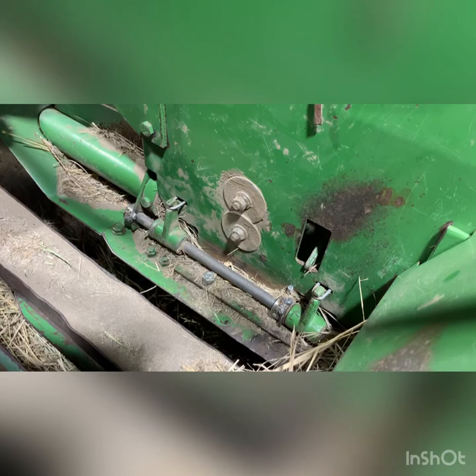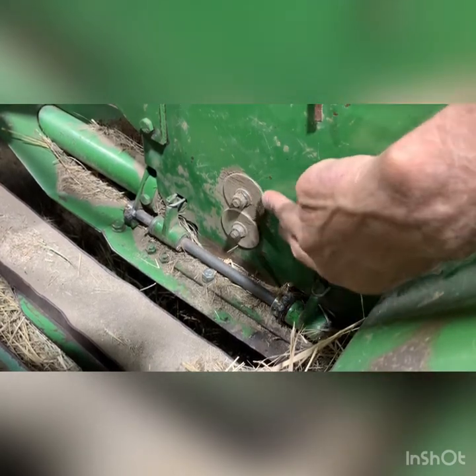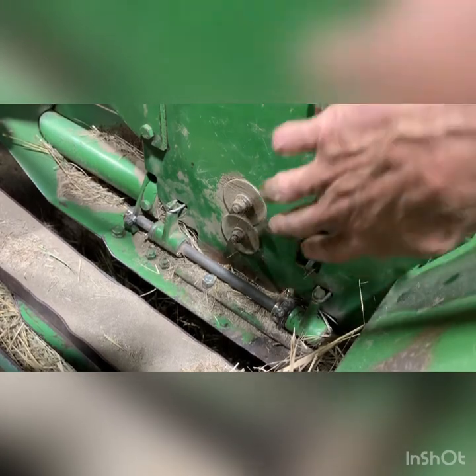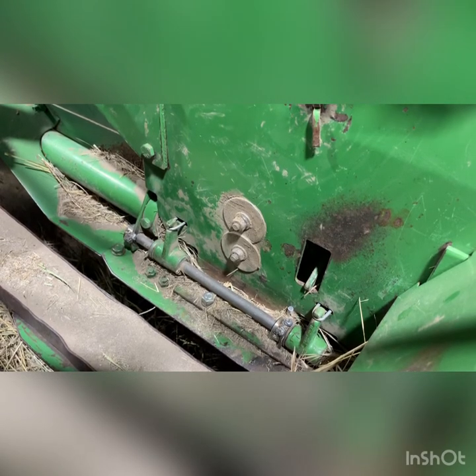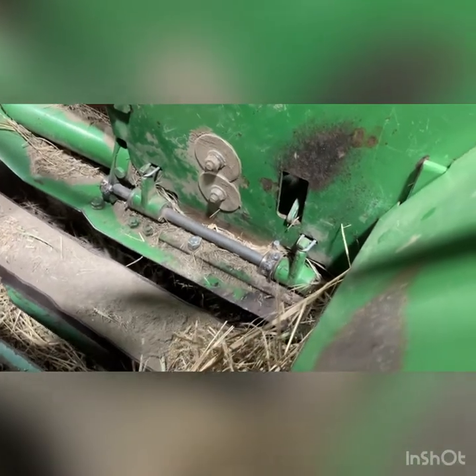A little bit of movement in there means they're going to wear a lot better. You'll see where I put in some fender washers right here because I had to make a big press and try to straighten this bracket back out — it had been beat up pretty good. We got that all straightened back out. Coming into the back side here, you're going to see this clearance right down in here. You want to make sure that clearance is in there. See where mine has been — it's real shiny right down in there — that's where it was rubbing.